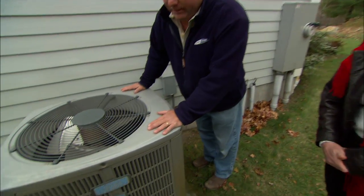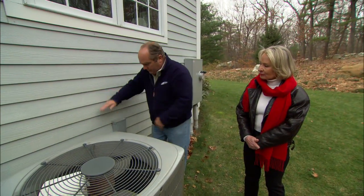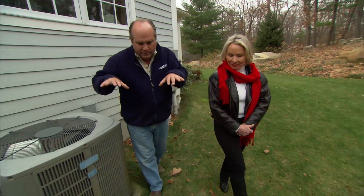Most people might know a heat pump because it might have equipment like this on the outside — this is called a condenser. When it's in air conditioning mode, heat is absorbed from inside the building into the refrigerant lines and dumped outside. When it's a heat pump, it can reverse and look for heat from outside to be absorbed into the refrigerant to go into the building. The problem is it gets really cold here and there's not much heat to be had. With geothermal, we can use the heat below our feet — once you get down four or five feet, it's about 45 to 50 degrees. So you've got to figure out how you're going to collect that energy. You could put pipes down five feet to collect it, or do a closed loop.